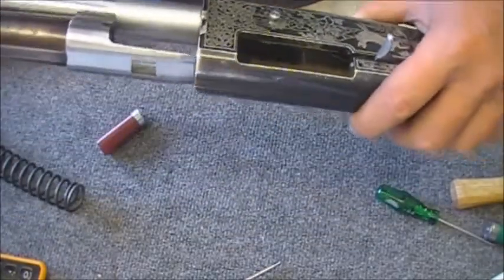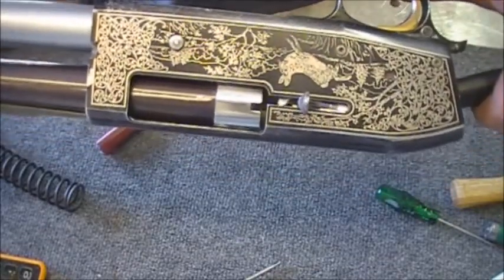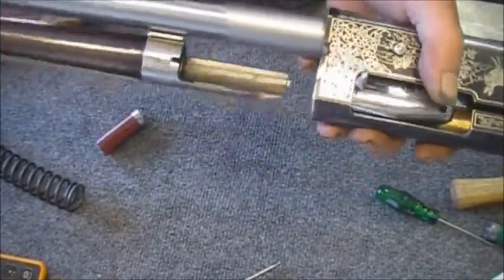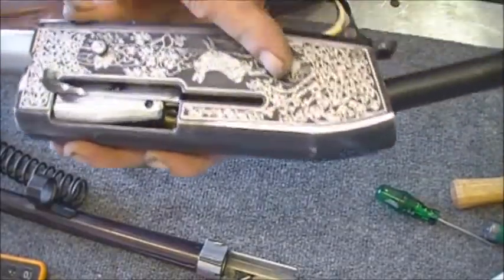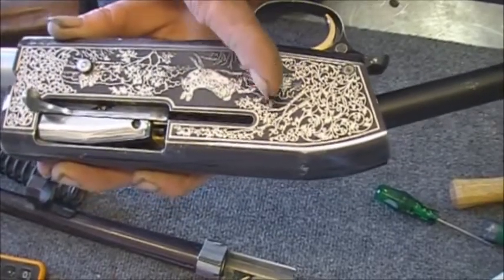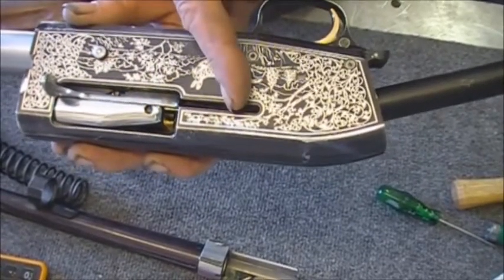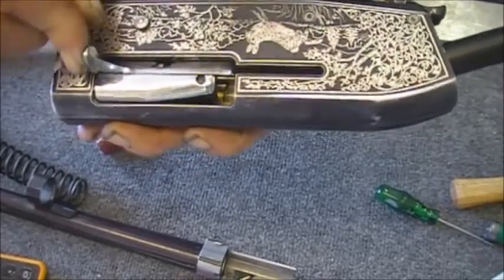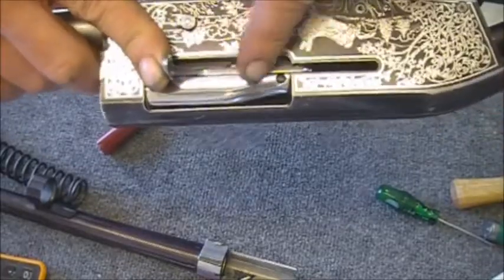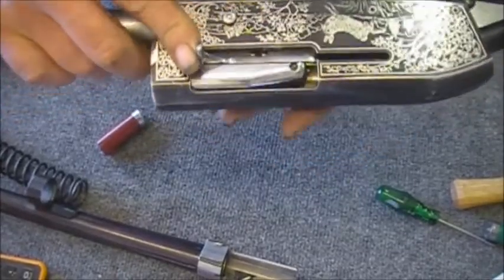What we're going to do is cycle back, closed, start coming forward, and we're not going to separate. What we're going to end up doing is just pulling that so hard we're going to override our flip latch piece — you can see it was rounded, not a lot of positive engagement. We don't want to be holding this super tight; we just want to hold it back. If we hold that handle back, it pulls our locking lug down when everything goes forward. The problem was our locking lug is not letting go of the bolt.